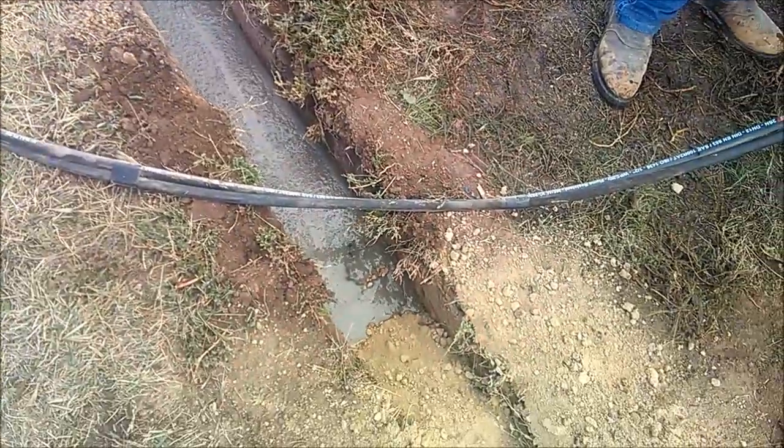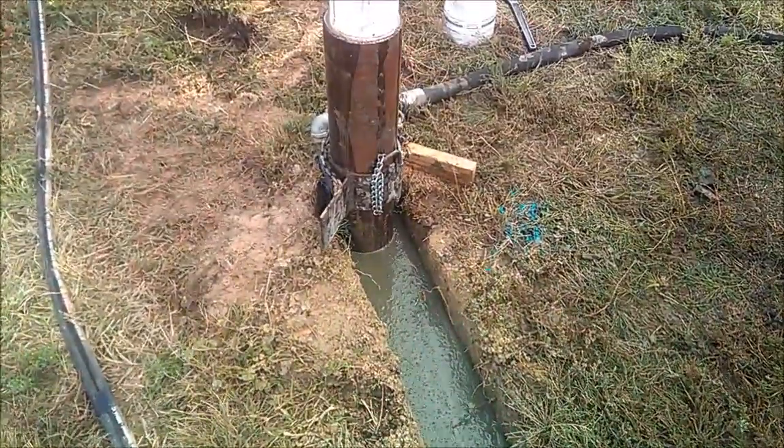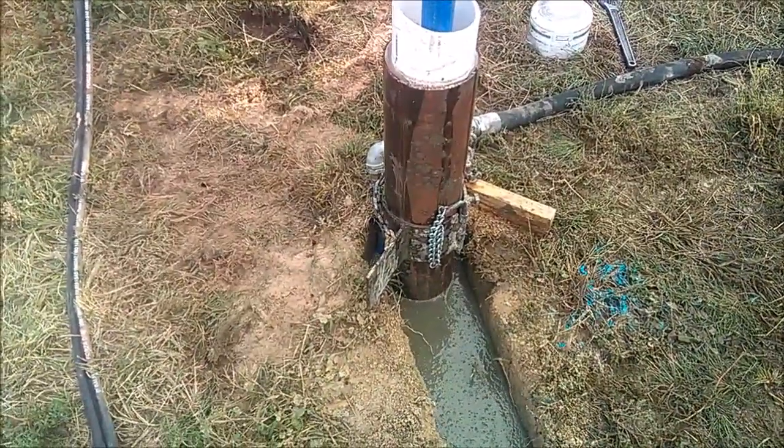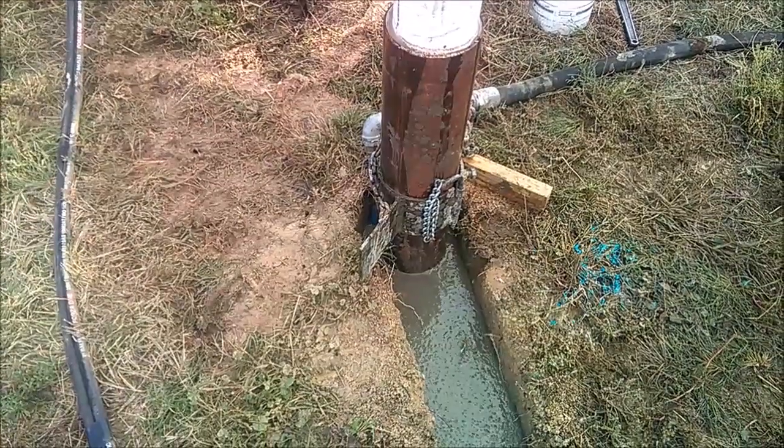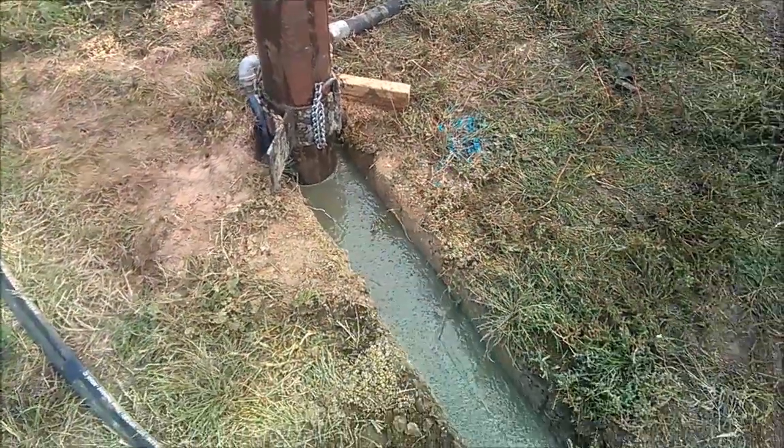When we get good cement coming out, shovel the end of the trench in, just save a little bit there and keep it for a reservoir. That way, if the grout settles back a little bit, you've still got some in reserve there.